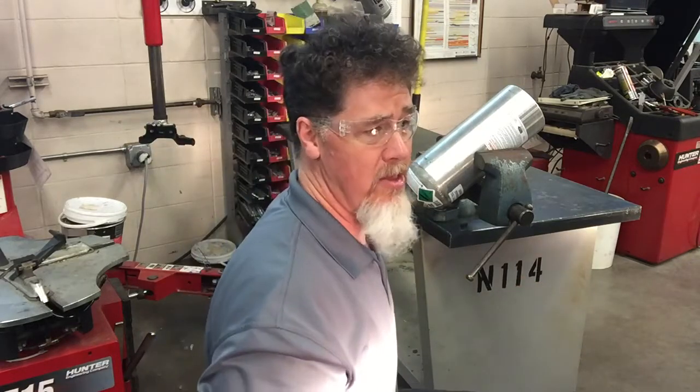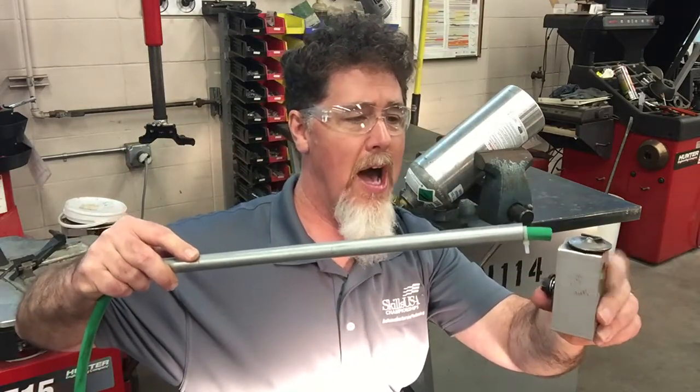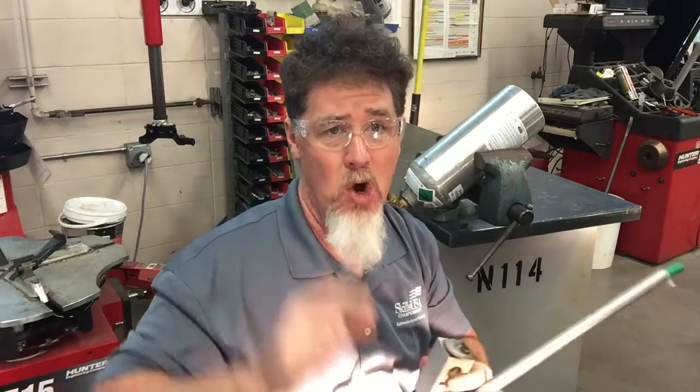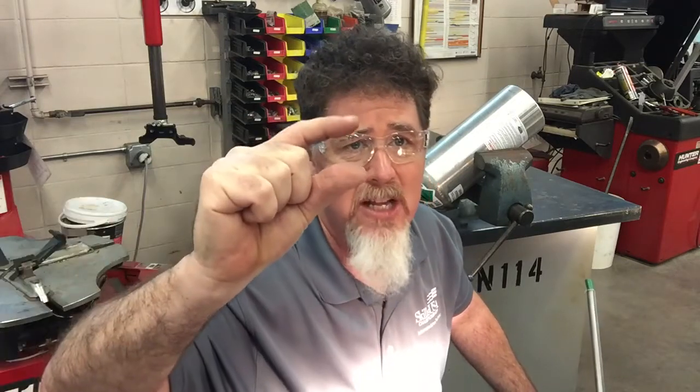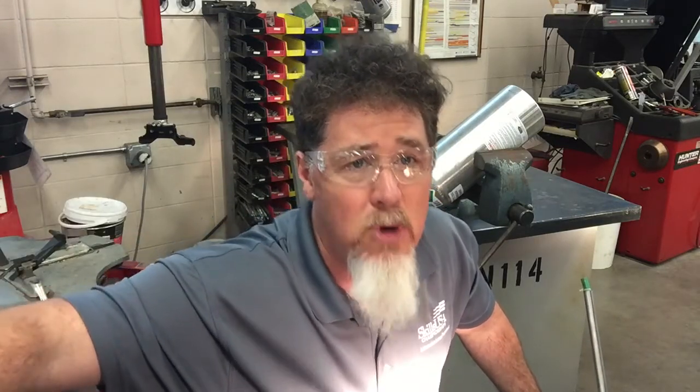Remember on the H-Valve, you're aiming your wand right there at that power dome in order to get it all iced up and get a response. So I know that this TXV is not stuck open and not stuck closed — it can physically open and close properly. I don't know if it's calibrated correctly, but I know it's physically movable and it's doing its job.